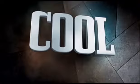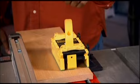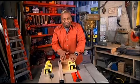Hey, I'm Chris Grundy. Ever see a woodworker do this? What they're doing is showing you they still got 10 fingers, and the MICROJIG gripper is gonna help keep it that way. You just hold this and feed the stock through the saw. You've got a nice firm grasp, and your digits stay far away from the danger zone.